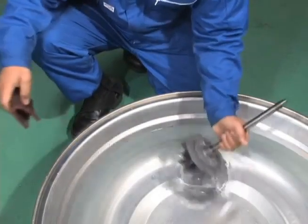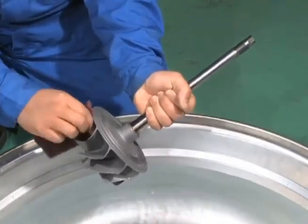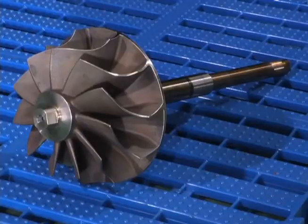After removal, clean the turbine wheel. After washing the turbine wheel, dry them thoroughly and coat them with rust-proof oil. In the event that the radial turbine blades are indented from collision with a foreign object, please consult with Mitsubishi Heavy Industries.